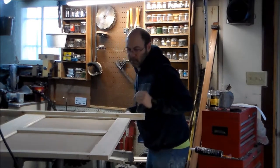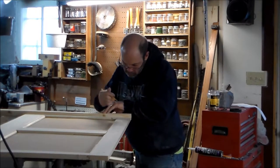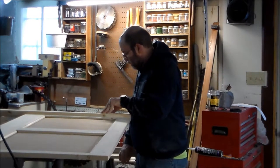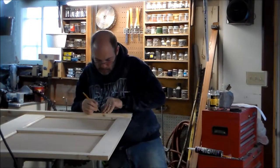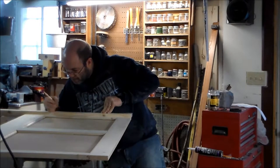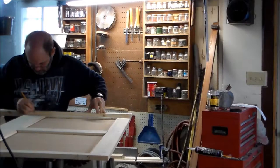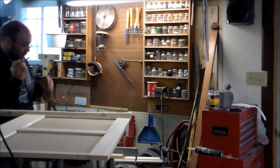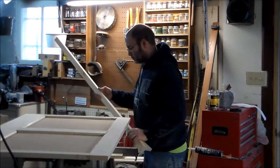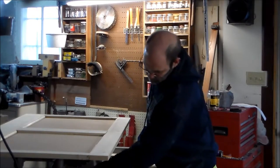All right. Get that all lined up. Put us a biscuit mark here and here. Put about four biscuits along each side here. Get down here and line on this one. Okay. Let's get our biscuits for this side done. Get out of the way so it don't. Okay.